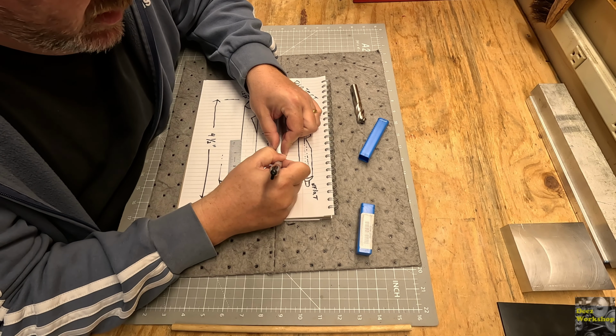and my angle finder. So this will hold our workpiece. Get that in there, and that's going to be the setup so that we can mill that angle in the whistle. Before we do that though, I need to mount this at 45-degree angle in the vise. Make sure the faces are clean.